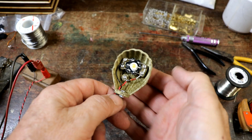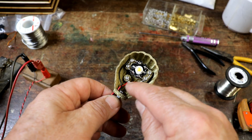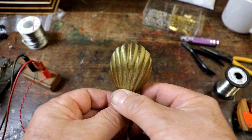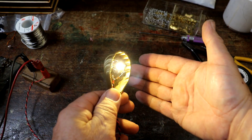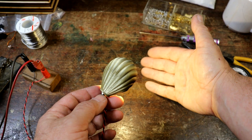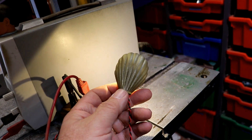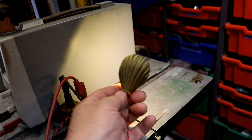It's done! Look - we've got the 1-watt LED sitting on its heat sink, and now we've got the 12-ohm resistor which limits the 5V supply enough to not burn out the LED. It does look lovely - all screws together beautifully. Now let's switch it on - perfect! Lovely warm white. Cool white just doesn't look right with steampunk because you've got the warmth of the wood and the brass, and cold harsh white light just doesn't fit - whereas that is lovely. And of course, if you connect these to an Arduino or Raspberry Pi, you can get them to fade up and down to illuminate your steampunk invention.